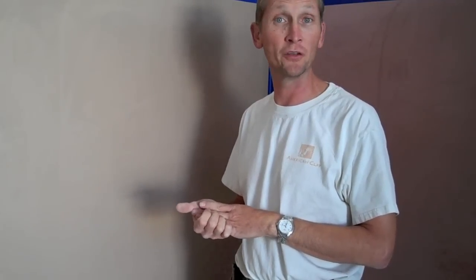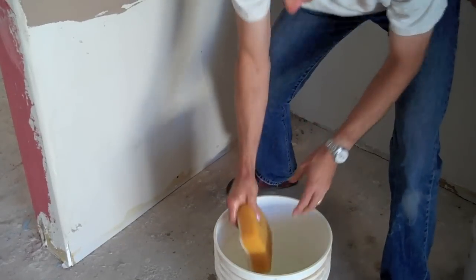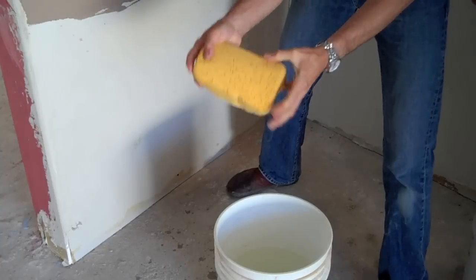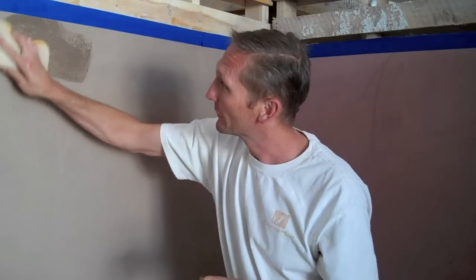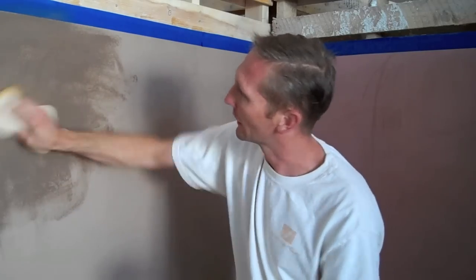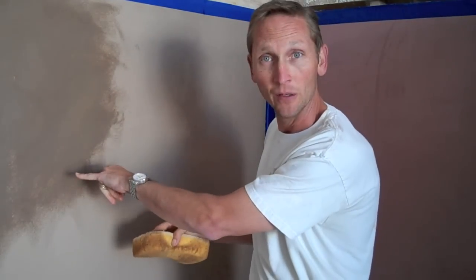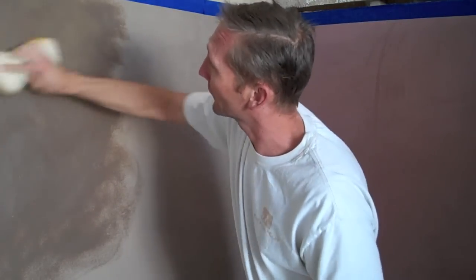The first thing we're going to do is a sponge compression on the surface that we've already textured. We want to show how much water is enough and how much is too little. Wring out your sponge — for most applications that's going to be enough. With a rough finish, leave about that much water still in, give it a light squeeze, and it's ready to go. Take it to the surface and evenly wet the entire surface. If there are dry marks, make sure they get fully wet, but don't get it too wet.